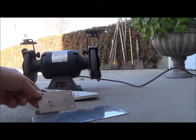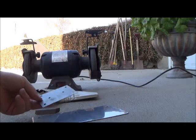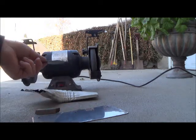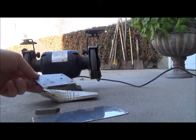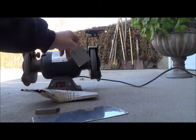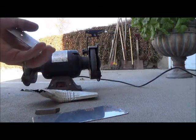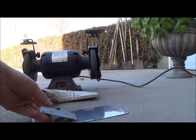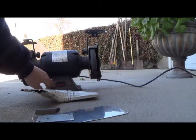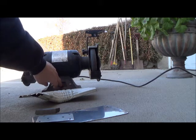So I've got a couple of test pieces here. Generally you can tell by the weight, but that's not always 100% accurate. So what you've got to do is get yourself a little bench grinder, turn it on and take the piece of metal, run it up against this and look for sparks. If there's sparks, that means it's stainless steel. If there's no sparks, that means it's aluminum. Now it's the middle of the day here, so I'm not sure how well we'll see the sparks, but that's how you test it.